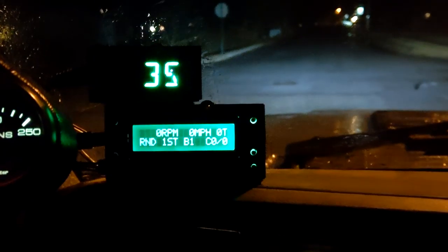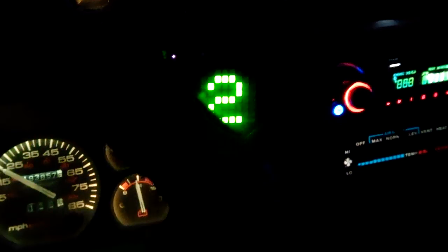Here we are out for a night drive — the Jeep is fired up. I've got this guy just hanging in here for right now. This is just auto mode to see the gears. Look at that, we're in second. You can see our torque converter is locked. There you go — fourth. When you let off the gas, the torque converter unlocks.